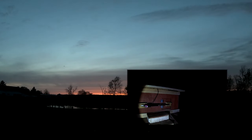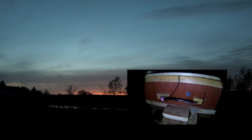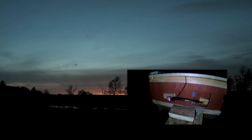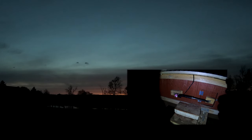This opener/closer has pre-programmed limits so it shuts down when it reaches the end of the cycle, using only a minimal amount of power. That's cut off overnight until it kicks on in the morning — I think it's set for 6:30. At 6:30 a timer kicks on for two minutes to open it back up. I have the closing timer set for four minutes just to be sure I'm not stressing the battery and that the door gets fully closed.